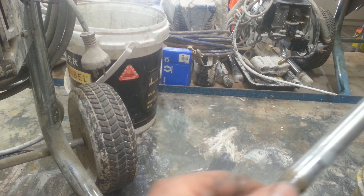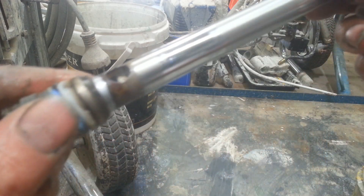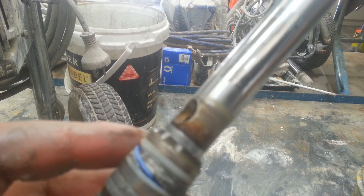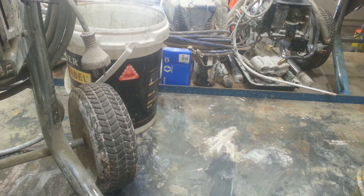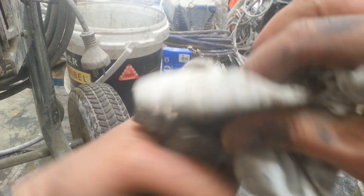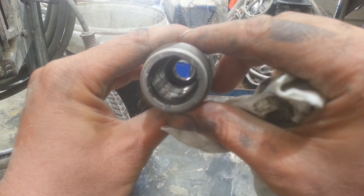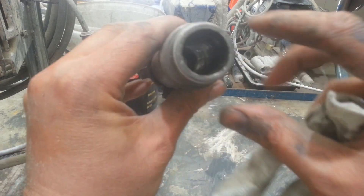Let's bring the camera out so we can get a better view. That packing is no good. I'll have a quick inspection of the piston rod for scoring or waving, which is just wear and tear in one area — you should be able to make out the scoring in that piston rod. I'll also inspect the housing itself to see if there's any scoring; it's very wavy on the inside, which means it's no longer a smooth finish.